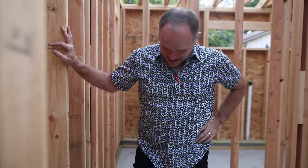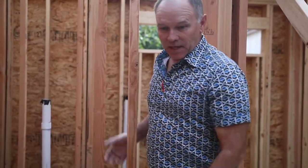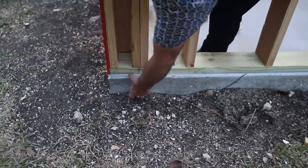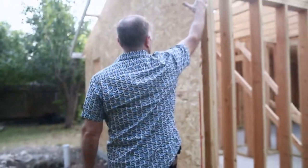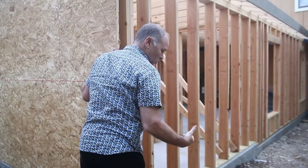Is that like the same construction as a basement? Similar, yeah — just a little mini basement. But that's how you solve water issues. A lot of people don't do that, and then water ends up coming inside and getting too close to the foundation. You can see on the outside here — we're nice and high off the ground and we can have ground sloping away. It's eight feet on the outside, a typical eight-foot height, and then it goes down further on the inside, so it gives it a little taller ceiling and a little taller wall.